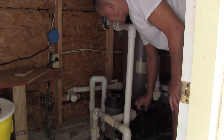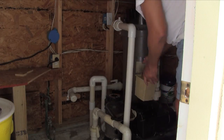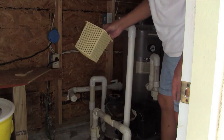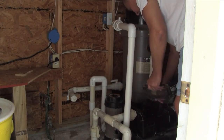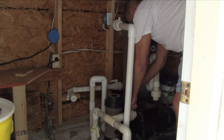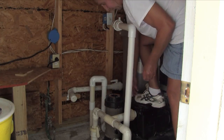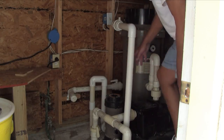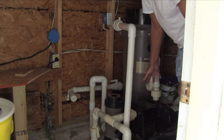While I'm at it, I'm going to clean this filter basket, which is not that bad. Now here's a little trick that might save you from breaking a cover: when you put your basket back in and put your lid back on, make sure there's no trash around the rubber gasket or around the edge of the cover. Put the cover on and just snug it up. Then, putting your body weight on the center of that cover, snug it down good. If you don't, a lot of times you'll break the two ears off the cover — I've had that happen more than once. Since I've started putting weight on it when I tighten it down, it works great.